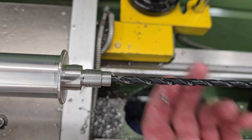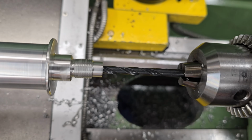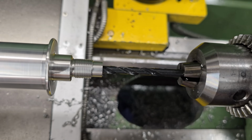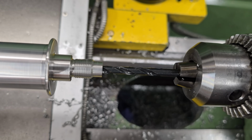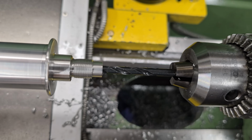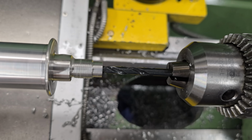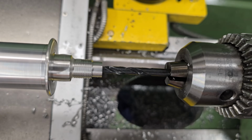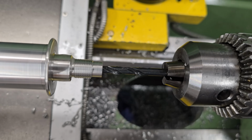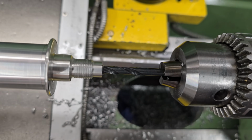As the pellet travels through the baffles, it doesn't actually have to come into contact with them in order to cause a problem. Depending on how the air is released from the end of the barrel and how it follows the pellet, having a super tight hole can sometimes cause pellet instability. To be honest with you, I think we would have been alright with the Vulcan, as it's a very efficient rifle, so there isn't tons of turbulent air following the pellet as it travels through the core.